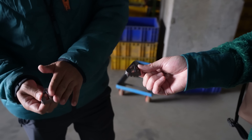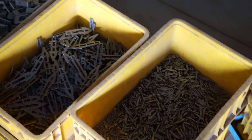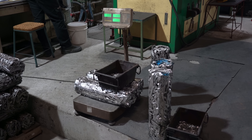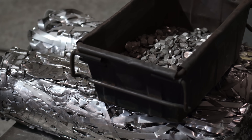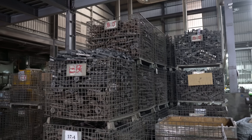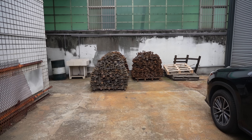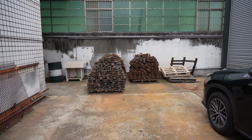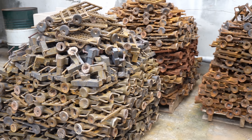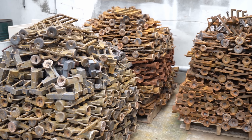A little bit of sanding and QC — and that's how you make a cast part. A common question is how much material is recycled. Essentially all of their material is recycled — they buy raw material from stamping factories, which is the remainder left over after stamping. That gets melted again and recast. The only excess cast material gets sold further down the ecosystem to sand casting, where you make really big parts like buckets for diggers or manhole covers. Steel is really recyclable.